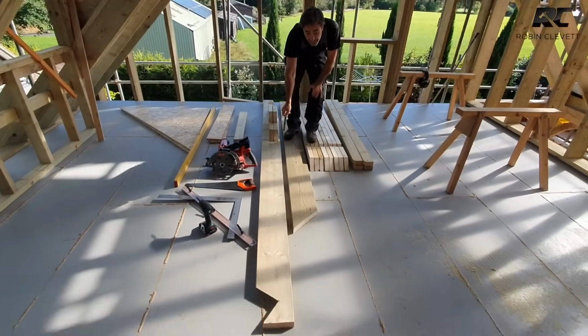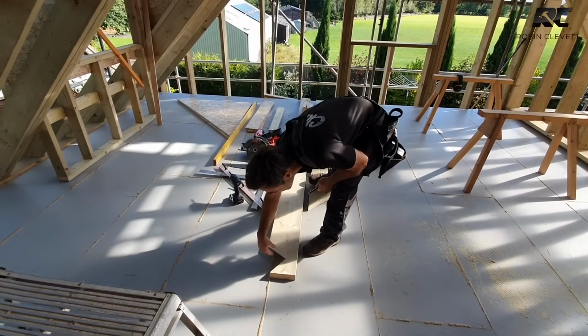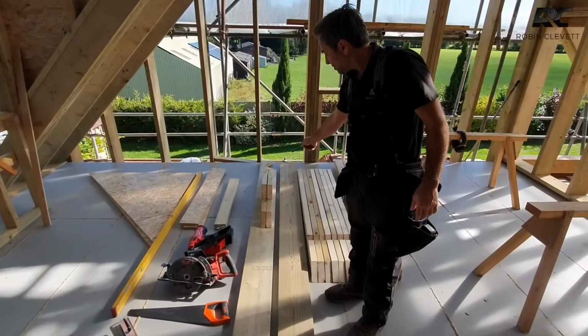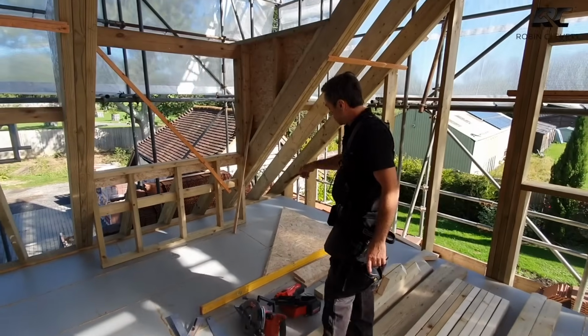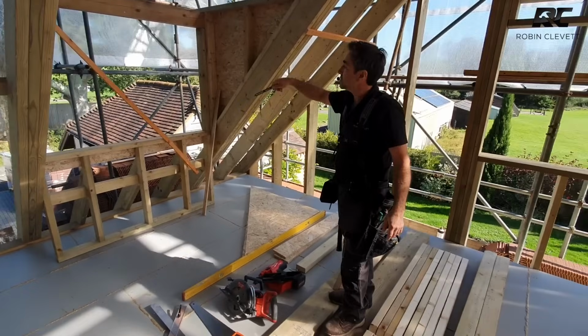which has been cut, a lay board which has been cut. It's got a bird's mouth on each end, obviously opposites, with a splay where they sit over the wall plates. Then I've got my valley jacks, my lay board jack rafters there. I've got a central stud which supports the back of the OSB on the gable, and then I've got my strips of OSB which go down the front.